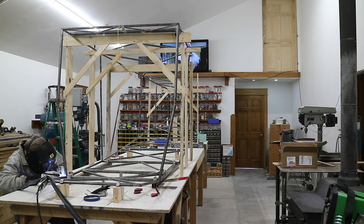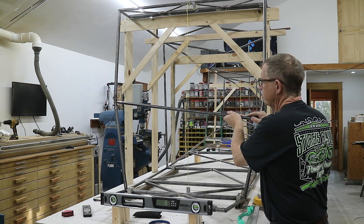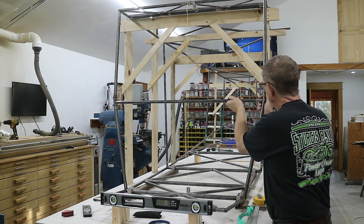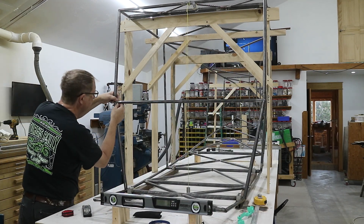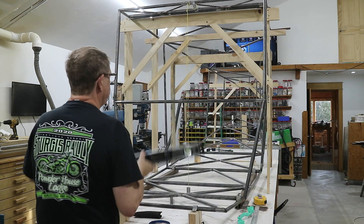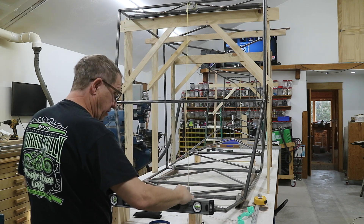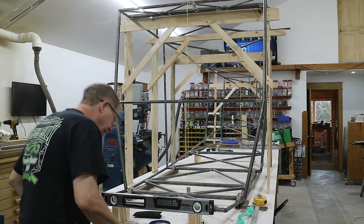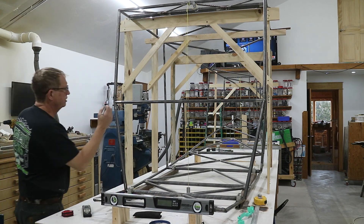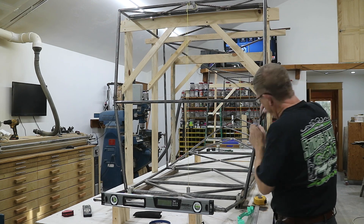B to P here has a cross tube that goes right here at dash level. I just finished fabricating that. I want to get it in there level. That looks good to me. I'll make some little tick marks there so that I can put it back in the same position if it moves around while I weld one side. Now I'll tack that in place.